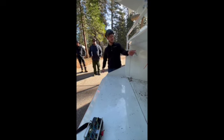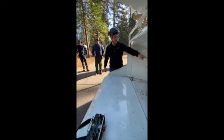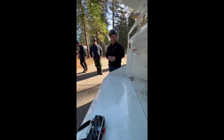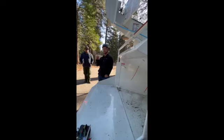Unless you have a lot of patience, it's a two-person job to actually do that adjustment. One guy up here with that tool checking your clearance, one guy underneath the machine moving it. This is the reason, guys, that you need to keep those knives in sets of 4.